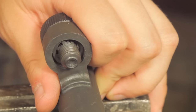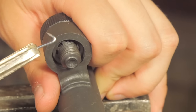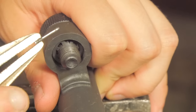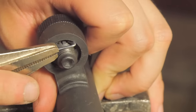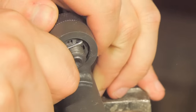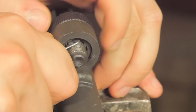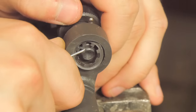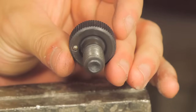There's probably a tool for doing this, but I don't know what it is. All I've done is taken a little nail and bent a hook into it — you could probably use a little fish hook. I've grabbed it in these needle nose vise grips and I'm going to hook it in between the teeth of that washer, and from there you can very easily start unscrewing that bolt. Easy peasy.